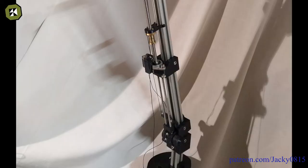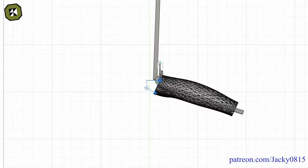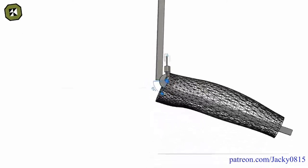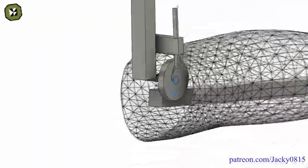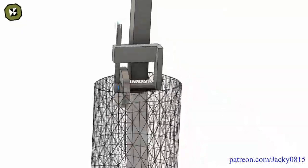Until November 2020 I worked on the knee joint and started with the hip joint at the same time. Although I am relatively satisfied with the second version of the knee joint, I had an alternative idea how to do it, which might even make the joint more stable, but that is pure speculation at this point. With this idea I question my decision to use a cord, at least in the foot and hip joint. For the toes I will have to use a cord because the motor will be in the thigh.